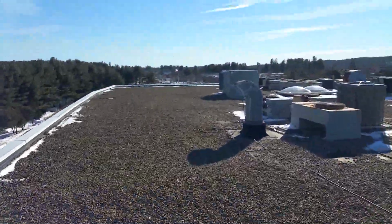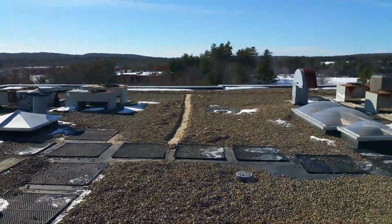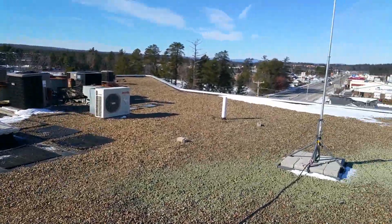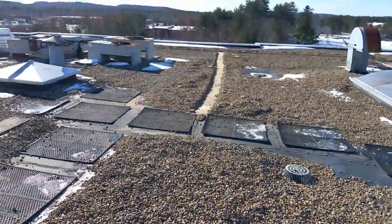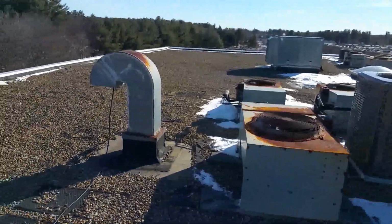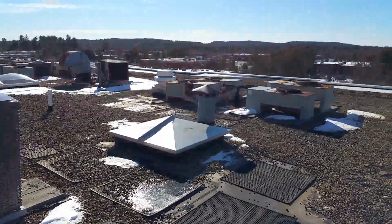As of now, we would recommend a level 3 tune-up, which would essentially have us go through and uncover every single seam, flashing, penetration, and patch on this roof, and we would do a full restoration system on just those areas and leave the field of the roof as is under the ballast because it's held up very well and has many more years of life expected in it.